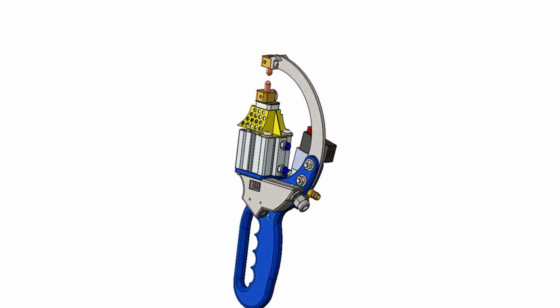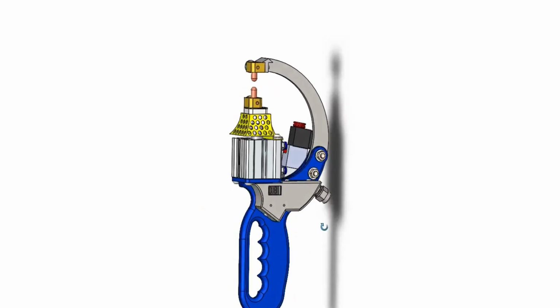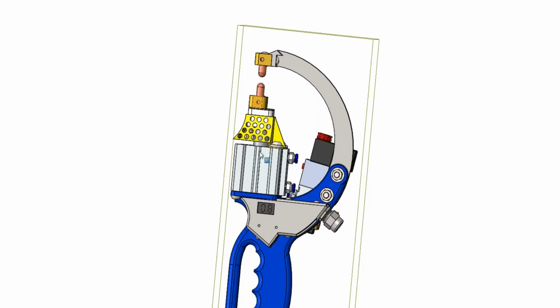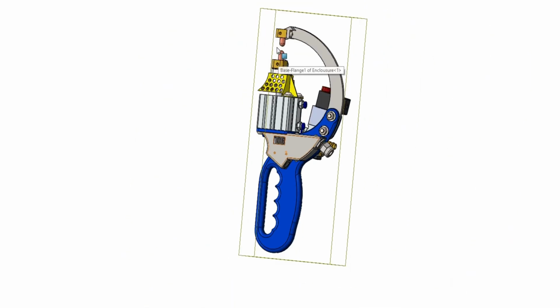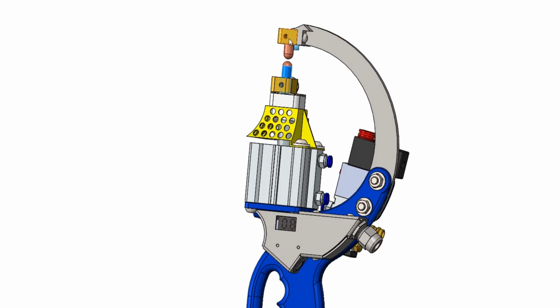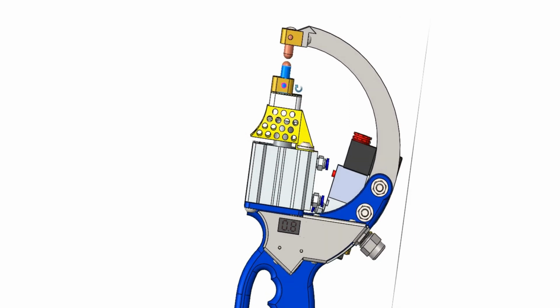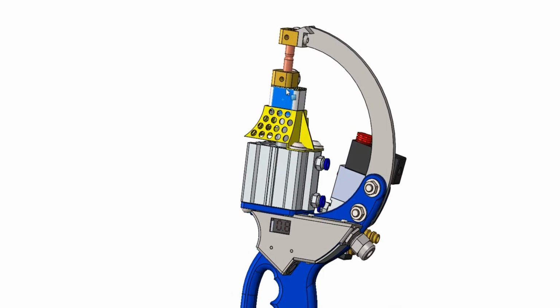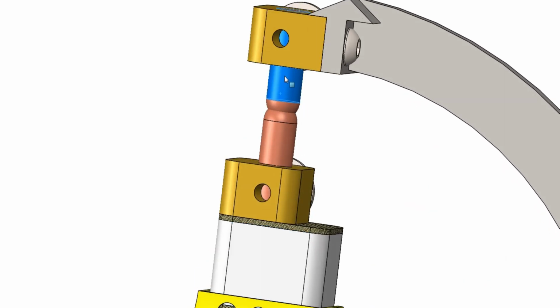Before we explode it, we're going to give a brief talk about the pneumatics and show you how the two electrodes approach each other when the piston shoots them out. First of all, when you push this button, the pneumatic piston shoots out and touches the electrode. These electrodes can be adjusted using the grub screws. There's actually none on it. There should have been grub screws in it, but they have vanished. I'm going to have to add them again. The nylon block pushes the brass block and the electrodes together. The electrodes need adjusted in this model. They shouldn't be coming together that close. This one just needs to move back a wee bit, but I have it locked.